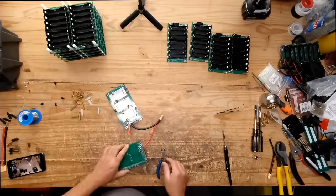Okay, so here's a very important thing. Even this right here, I've gotten a lot of questions from people. This shows a voltage of 52 volts in here, right? Even though these are not connected, the BMSs don't have any feedback from the individual groups of cells because these cables are not connected. So there should be no power in here, but this shows 52 volts. Now, is that a real voltage?